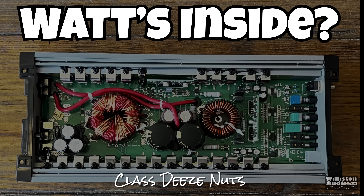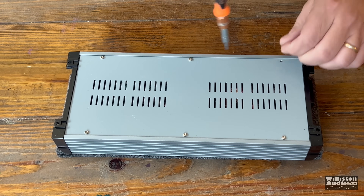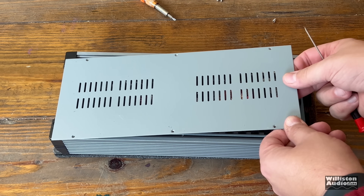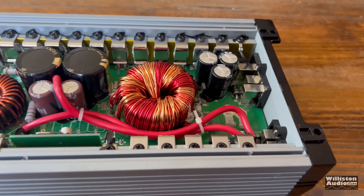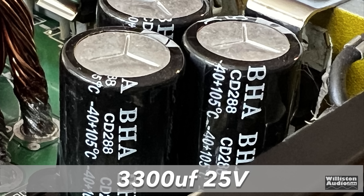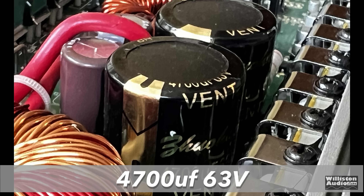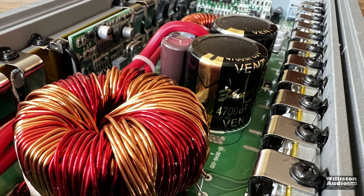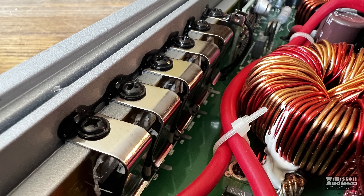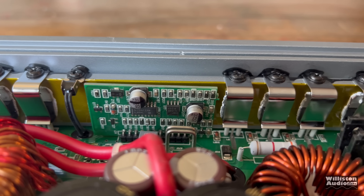Now let's take the bottom panel off and find out what's inside — Class D guts. Flip the amp over: there are six screws on the bottom and they do require a torx screw. Check the video description for a link to my favorite precision screwdriver which includes torx bits. And there you go — Class D monoblock. I talked to Sam over at BearVids and he said this looks like a Maxonix clone. 3,300 microfarad, 25 volts for the input filtering; 4,700 microfarad, 63 volts for the rails — those look kind of gold, fancy. Also notice the way these clamps are set for the MOSFETs — Sam says he's seen them before but they look kind of rare. I like how you can take them off easily with just a screw.